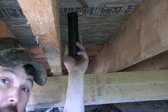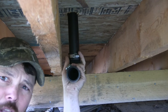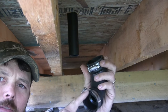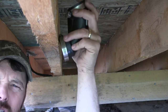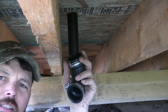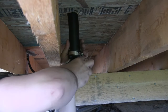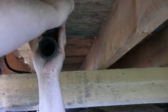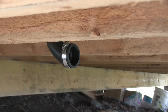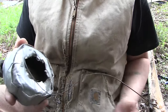Here we are up underneath the subfloor. Here's where my pipe dropped down. If my measurements were correct — which they should be — when I put this elbow on here, the top of the elbow should be pretty much flush with the bottom of the floor joist. That way the pipe can exit the building, and when I go to insulate this floor it'll be out of the way. From the side, looks like it's just about right.